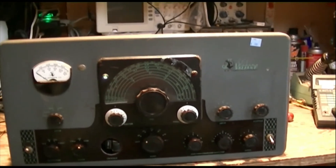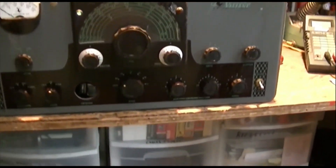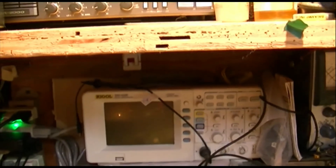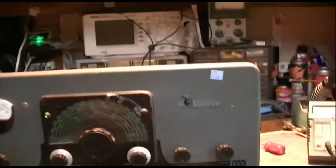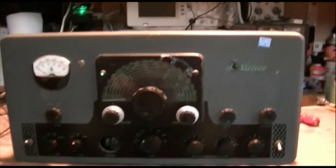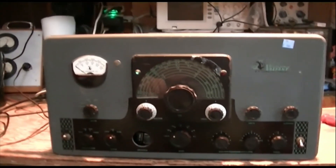I'm not quite sure where it's arcing or why. I didn't check the SWR on this — let's do that right now. Yeah, it's almost entirely flat, 1.1-to-1 or something, so that's okay. Not a problem there. So that's the result of the work we've done thus far.